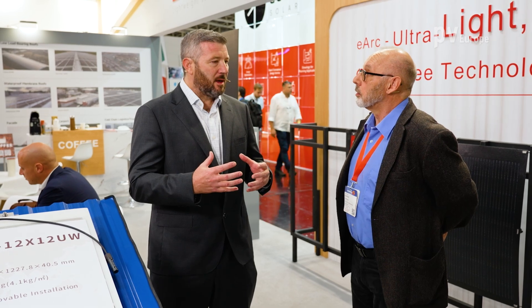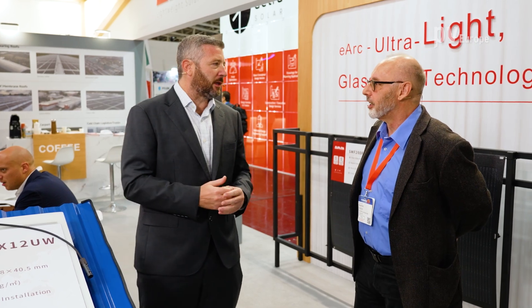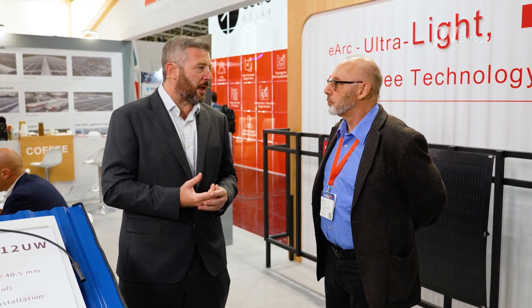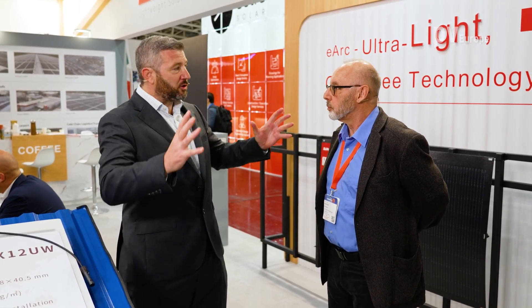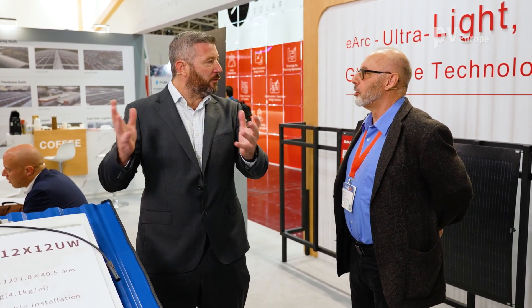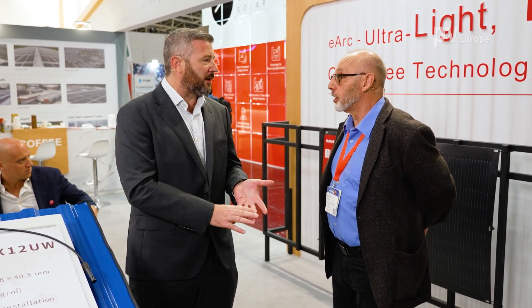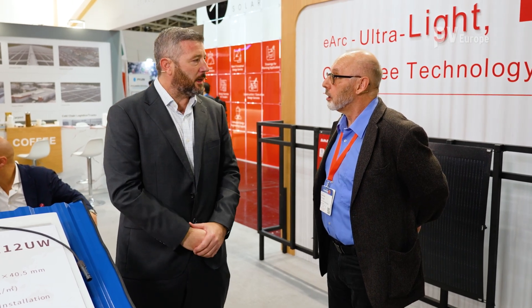So this sounds like a trigger for the module market — is this your feeling from the market? We really feel we're at an evolutionary split. Glass has been the predominant manufacturing technique, but glass is bulky and heavy. Poor installers who have to carry 30 kilogram panels up on a roof — they just weren't designed for that. In ten years' time, there'll be glass module manufacturers predominantly serving a utility market, and lightweight solar manufacturers servicing the rooftop market, because you want lightweight, easier, quicker, lighter solar.